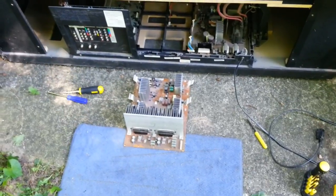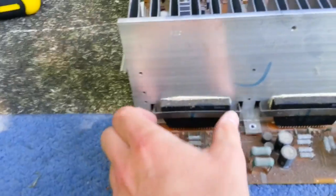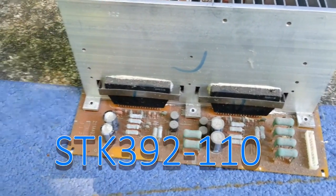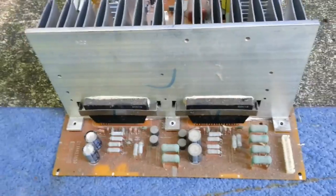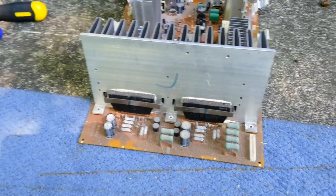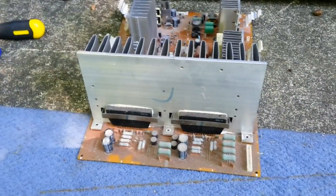In that case, you can get a pair of them — I think reputable online stores still sell a pair for around $35. The number on them is covered up by the clip, but when it comes off there will be a number on there. For the Mitsubishis it's usually STK392-110. For the one upstairs, we replaced them with STK392-180s. For other sets and even different Mitsubishi models — this is like their 2002–2003 model year ones — there's a database online where you can find the exact numbers. You'll want to get either the exact originals or confirmed compatible replacements.